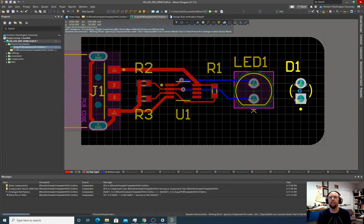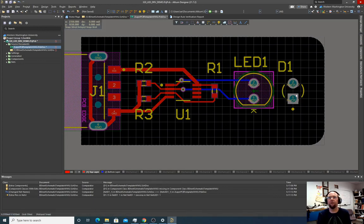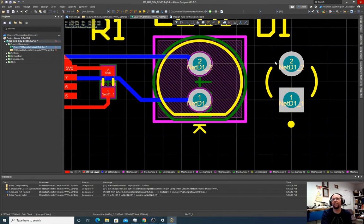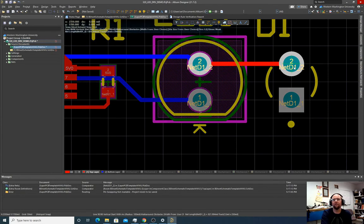Okay. Space and rotate. Yeah. Okay, so now we're going to put this other footprint here. Why are these the same size? I guess the pitch is the same on 5 millimeter versus 3 millimeter. Huh. Learned something new already. I didn't know that was the case. All right, well, let's wire it up. Same thing. Who cares? We'll have shotgun LEDs here. It doesn't matter which layer we do this on right now.